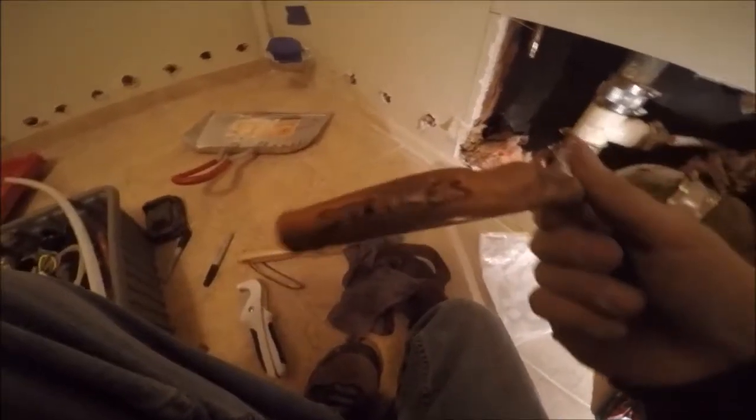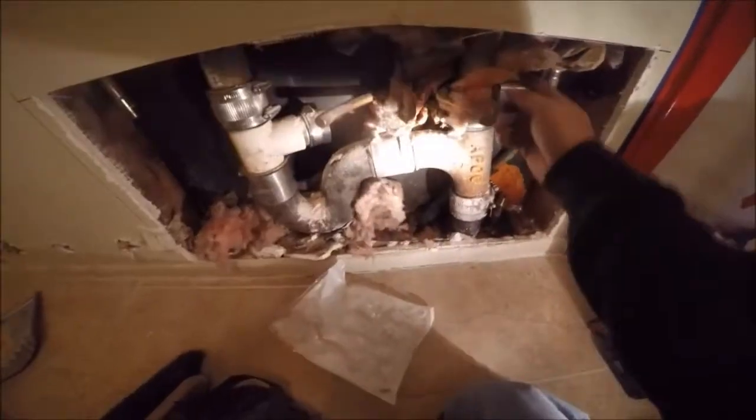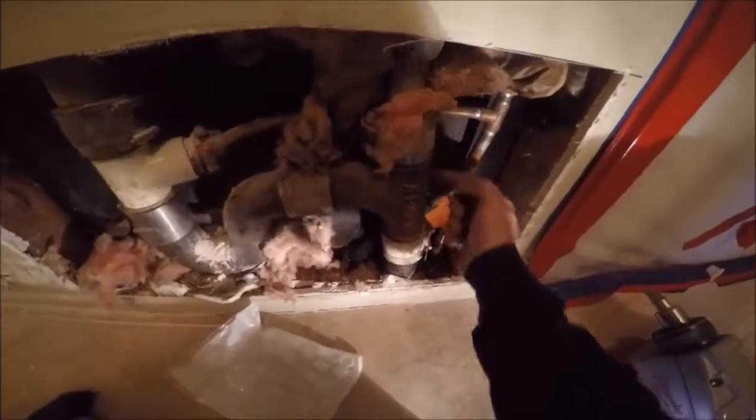Fast Eddie strikes again. I cut that out — it was soft copper over here. I don't have soft copper, so what I'm going to do is put in Wirsbo and run PEX, fish it from there to there. That's a lot better to be up against cast iron anyway, because you don't want two dissimilar metals touching one another. They've got some sleeve in there with a little bit of room, but in this case I want to come up and around. I could do it in hard copper, but then I've got the dilemma of them touching, so I want to avoid that. I want to bring PEX in and get it tied in.